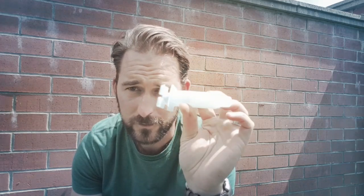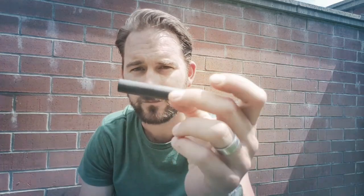The last option is a lot more work, but I really like this too — especially if you've got wires that are kind of exposed, trying to hide them under a deck or up in a tree, and you don't want a big connection hanging from your deck or from a tree. These are inline connections — basically just a shrink wrap tube that's actually gel filled. When you heat these up, it seals around the wire. You slide this onto the wire, make your connections, slide that over them, and then with a small mini torch you melt it down and it grips down on the wire. The gel fills so no water can get in, and once it hardens it's pretty much as good as a regular wire that hasn't even been cut. That's another really good option.